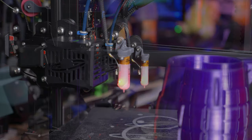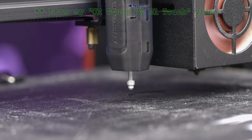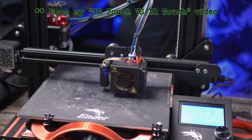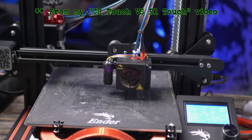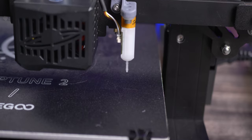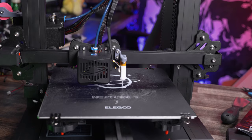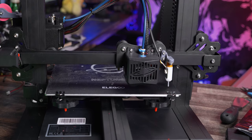With all the explanations out of the way, it's time for me to explain why I'm removing the BL Touch from my Neptune 2. I just don't like the way that Elegoo has implemented auto leveling on the Neptune 2 — it's not the way I would expect or want it to operate. I have multiple machines that run auto bed leveling sensors, but they all operate differently. Those machines have start G-code added in the slicer that tells them to run an auto level before every print and then use that data within that print — so you have a fresh, accurate reading right before every single print. However, on this machine you have to go into the menu system and tell it to do an auto level, and every time it does, it erases the Z-probe offset and you have to redo it after the auto level. I would want to do an auto level before every single print — maybe when I remove the bed plate and put it back on something changed, maybe I bumped one of the wheels. I should update that data before every print, but now I have to reset the Z-probe offset every single time.